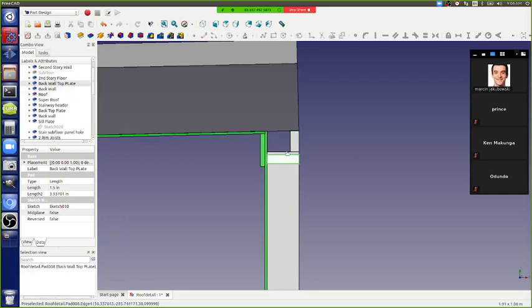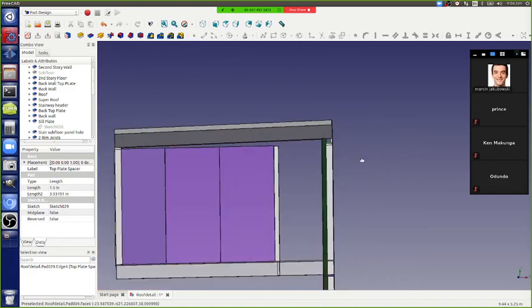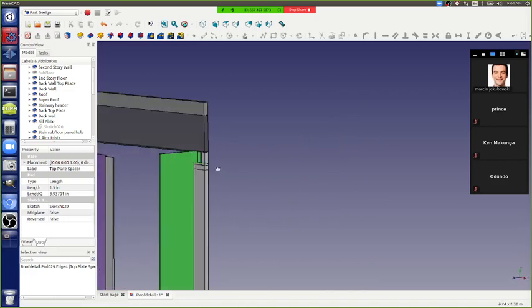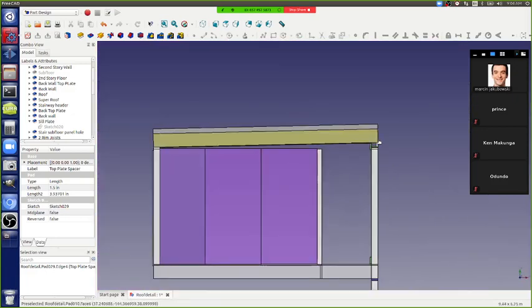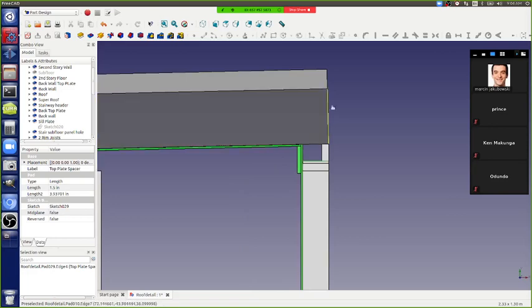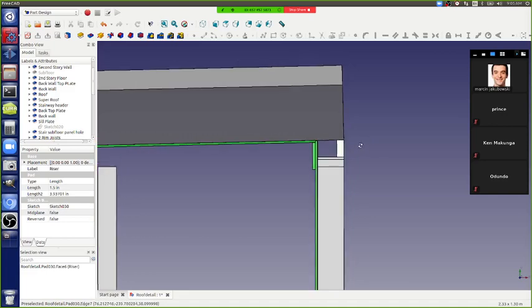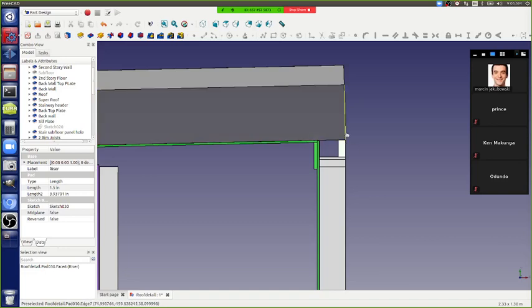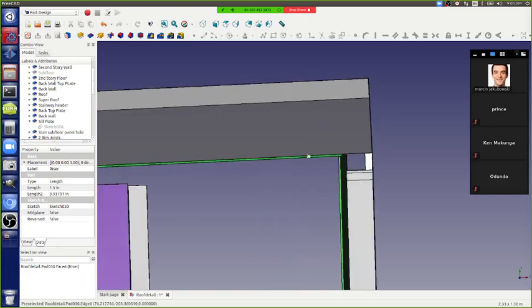So is the only thing holding up the roof this angled 2x4 and its plate? Not exactly, because there's exterior siding, and that's what really is holding it together. On the back of this thing, you're going to have the plywood. Okay, and you do see it does go up. Maybe that is a question. I don't really see a lot of issue with that. That is bearing on that. Once you put all the plywood on the back surface, the 5/8 exterior plywood, that bonds in tight.